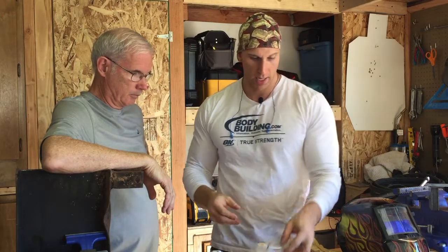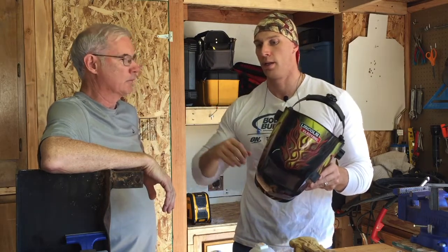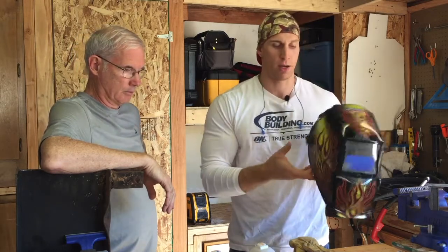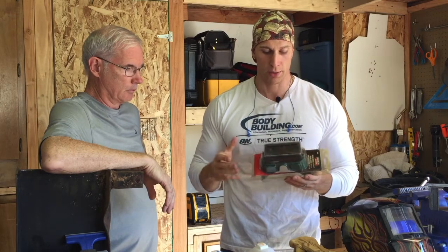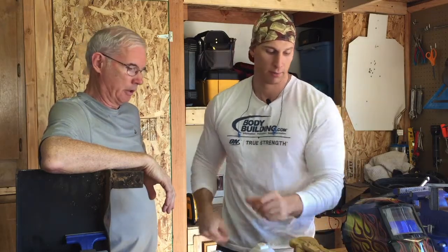You can choose to wear the auto-darkening or just a welding helmet. I have the auto-darkening. I turn the sensitivity down so right before I make my cut, I can actually see what's going on, and then when you get done the light will shut it off and it goes back to normal. I also have just a normal pair of cutting goggles. They're not the most comfortable, but safety trumps comfortability every time.